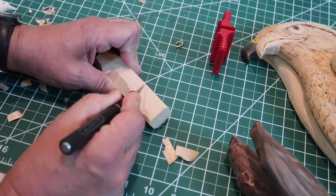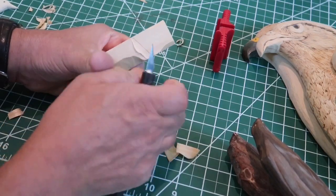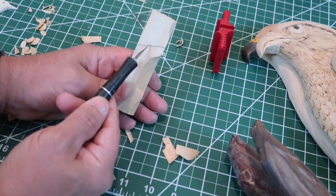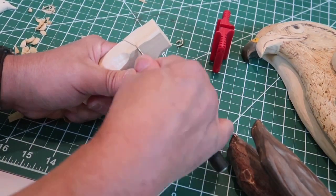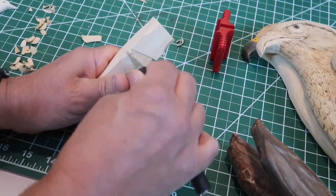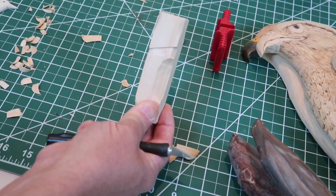So I'm just going to strike a line across here with a nice sharp blade. I'm going to use my pivot cut and just relieve underneath that line. Now we have a shadow line. There's a shadow under here that really makes it stick out — it gives you the difference between this piece and this piece. Stop cut there, stop cut here. Now it really looks like it's set back. By taking back these edges here, it really looks like it's a different size almost.